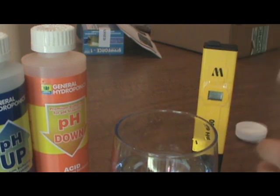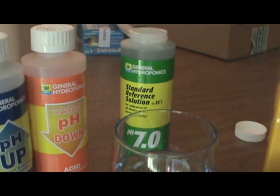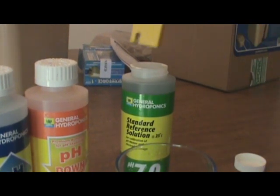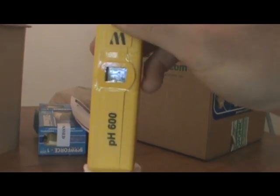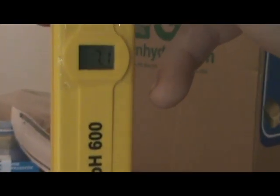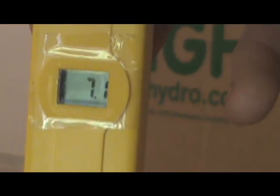So what we're going to do is take the top off. You can either pour this into a cup and then use that, but honestly I just go right from the top — which the manufacturer recommends you not doing because of contamination. After a while, this bottle is going to have contaminants from going back and forth like that. So it's really good to have distilled water and wash out between every time you do it. Anyway, you just go ahead and turn it on. And as you can see, it's supposed to say 7. So it says 7.1, which is 0.1 off — which means it would need calibration.